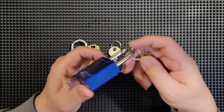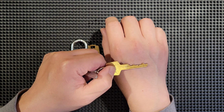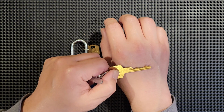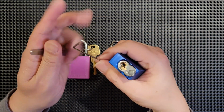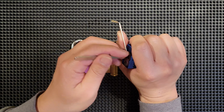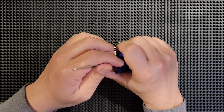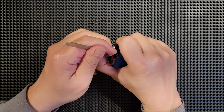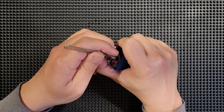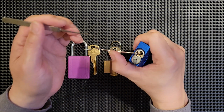This PacLock 90A Pro, for instance, has some nasty bitting. It has on pin 6 a max lift right next to, hidden behind pin 5, which is a 0 lift. And you can see some nasty ups and downs there, right? So when I go with bottom of the keyway tension with this lock, I don't have enough room to make that high lift in the back of the lock on pin 6. And even if I go top of the keyway tension, I would start at the back of the lock on pin 7, 6, and I can make that high lift now. I still have to have the tip of the pick directly on the tip of the pin in order to make that high lift. But then I would overset some of those 0 lift pins.